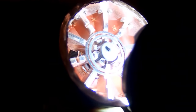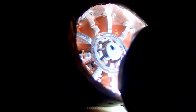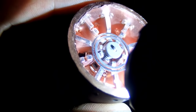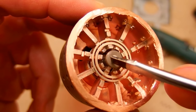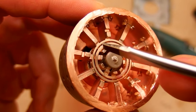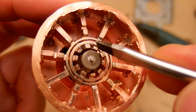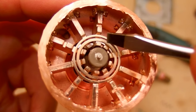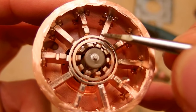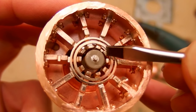The cathode is made of thoriated tungsten wire, which is also slightly radioactive — but not much. It's basically just a heater filament which emits electrons. The electrons go from this cathode and circulate or swirl in the magnetic field and go to those anodes. The flow of electrons alternates between the odd anodes and even anodes — the anodes basically oscillate. One group is positive, one is negative, and then it swaps. When the electrons hit one of the anodes, it pulls the voltage on it down and the other anode goes up.